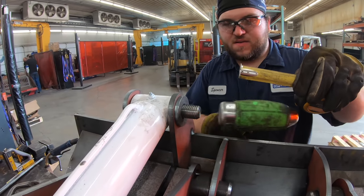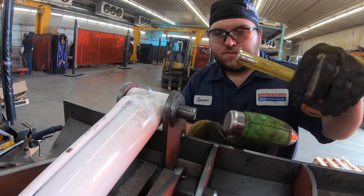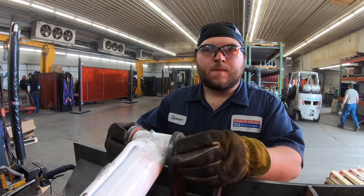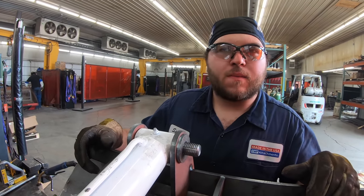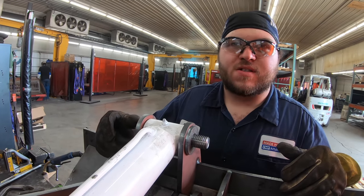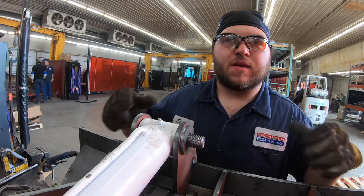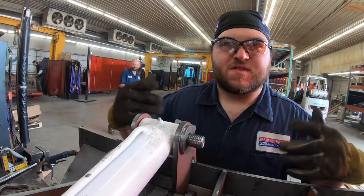Setting the thread, setting the bolts. These are all stress proof bolts instead of 1-inch regular grade 8. Okay, stress proof. Yeah, a grade 8 would work, but stress proof is kind of like AR, but in a bolt form. It can handle getting pushed on by a cylinder constantly without snapping. Yeah, it can bend a little bit without just snapping.